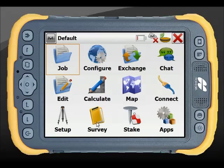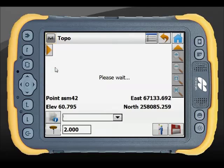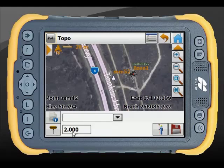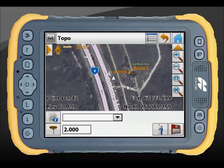If I now go into my survey and topo screen, notice I have a vertical antenna here and it's at a height of two metres. I'm just going to move my simulator here. I've put my base on a nice location away from the road — it's nice and safe and has a clear view of the sky. I'm now going to occupy the SSM with my rover. It's important to note that you do want a good position, so whether that's using a bipod or a light tripod, it would be worth doing to maintain your accuracy.